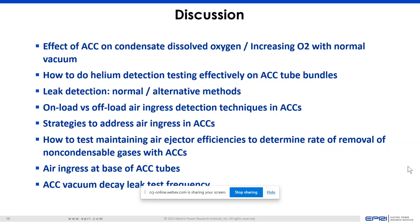It's dependent upon the type of unit. We wouldn't be so worried about dissolved oxygen in a combined cycle plant, but in a conventional subcritical plant, large in-leakage could cause us not to be able to operate optimally and allow closing the vents on the heaters. Also, if there's a very small leak but it's bubbling into liquid condensate, that could cause a significant increase in oxygen where there may not have been enough in-leakage to notice otherwise.